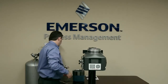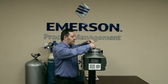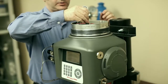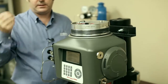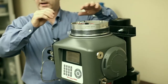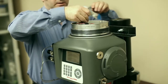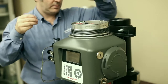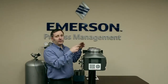So I'm going to put this to the side. Now what we want to do is remove these O-rings, because we're going to put new fresh O-rings in there. A neat little trick is that 2mm hex wrench — if you put that in the middle of the O-ring, it's really easy to lever it out. You want to be really careful that you don't use a screwdriver or anything sharp, which might scratch the sealing surface. That's why the hex wrench works really well — you don't touch the metal surface, you just go on the inside of the O-ring and pull it out. Now we've taken all the O-rings off.